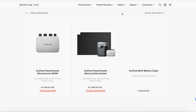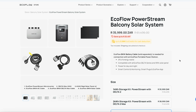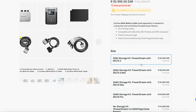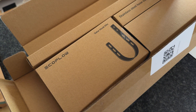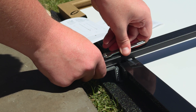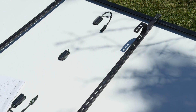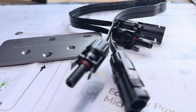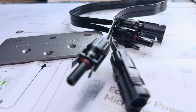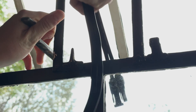EcoFlow wants you to know how approachable this setup is. The brand sells the PowerStream with an option of balcony mounts and what they call super flat cables. The balcony mounts are handy metal frames that can be installed onto the rigid solar panels and then mounted onto the side of your balcony. They are screwed into the existing holes on the panel itself and feel incredibly premium. You then attach two clips onto each side of the panel which act as hooks for the balcony. The super flat cables are your traditional MC4 cables but can be fed through windows and even under sliding doors — you can even close the windows and door with the cable fed through.